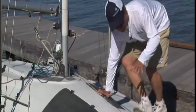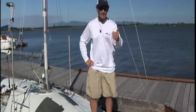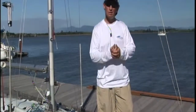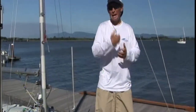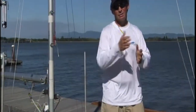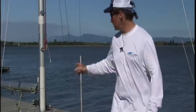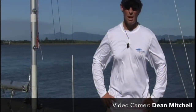So that's principally what we look for when we're going upwind, in conjunction with using the tuning gauge and utilizing the tuning numbers from the sailmaker. Watch the leeward shrouds very carefully. They will tell you the story, you'll find, of how the mast is set up. Is it set up properly or not? And the question to always ask yourself when you're sailing the boat, particularly upwind, is am I overpowered or am I underpowered? Very often, a lot of teams will know when they're overpowered because the boat's heeling over. There's a lot of pressure on the rudder. So most pertinently, very often, it's am I underpowered? Do I have the necessary power to take us through the light wind to keep the boat moving fast at all times? And that's, as I say, the visual gauge of looking at the shrouds can be very helpful in conjunction with using a tuning gauge and consulting your tuning guide. That's it for now.